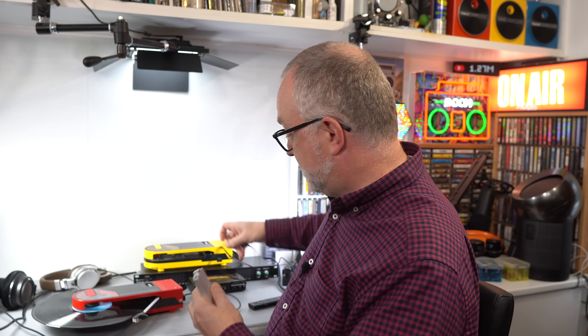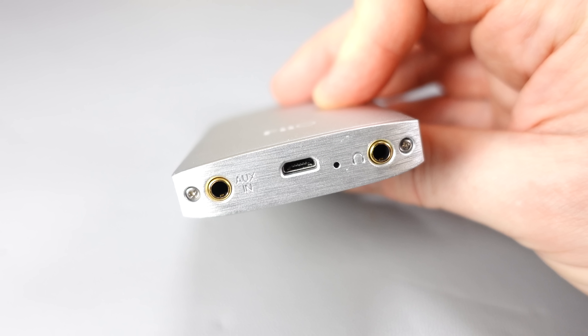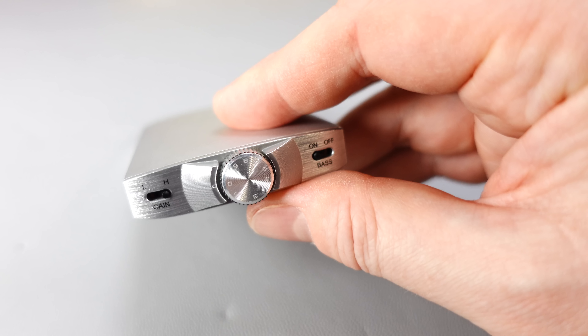That's exactly what this headphone amp does. You plug your line out from the Soundburger into one of the two sockets on the back marked 'auxiliary in,' and then the other socket is where your headphones go. You get a volume control on the side, which also doubles as the on/off switch on this device, and you can drive your headphones as loud as you want. There's even a gain switch — low and high — to adjust for varying line output levels from different devices. It's rechargeable, since it needs power to amplify.